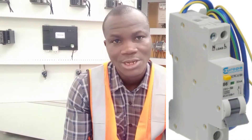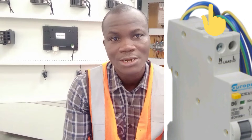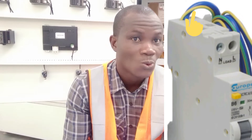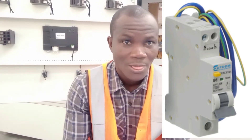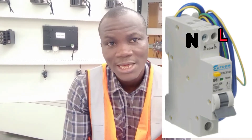So this is how the smaller ones look like. It has input live and neutral connections, and sometimes it comes with an earth connection. Let me talk about the one with the earth connection first. In case you are connecting this in your wiring, the input live is connected at the down terminal here, and the neutral is already brought out. This blue wire is the input neutral connection, and then this yellow and green cable around the blue one is the earth wire. So you connect the blue wire to the neutral terminal in the consumer unit, and then the yellow and green will connect to the earth terminal in the consumer unit, and then the output live and neutral connections are taken from here to the load.